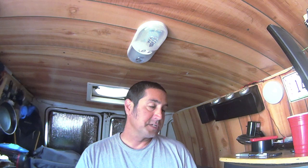Now where I run into needing more power is that my battery bank can only hold so much between those two batteries. They get topped off by about 10 a.m. and basically just equalize and stay charged throughout the day. Once the sun goes down I'm no longer charging and I'm just using the power, and typically I won't deplete them overnight with my fridge running on and off and charging my cell phone.